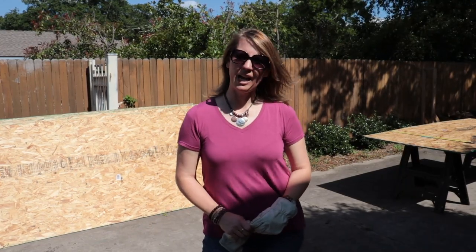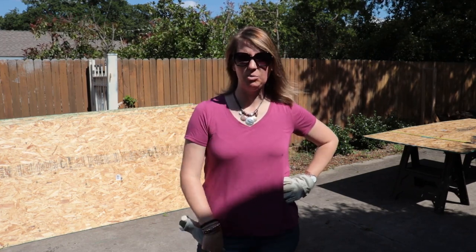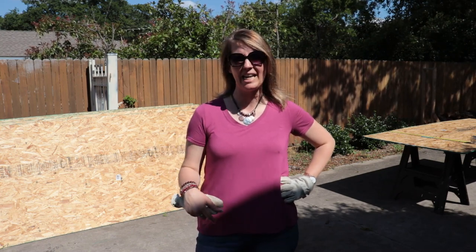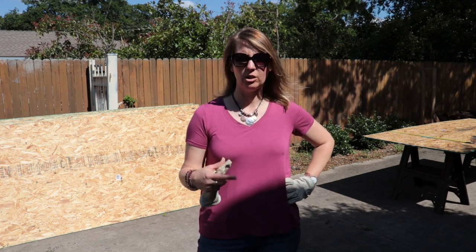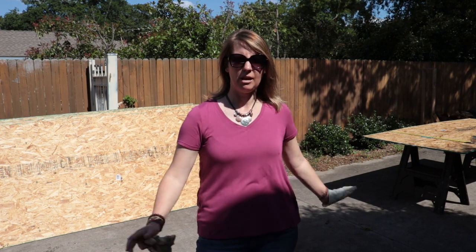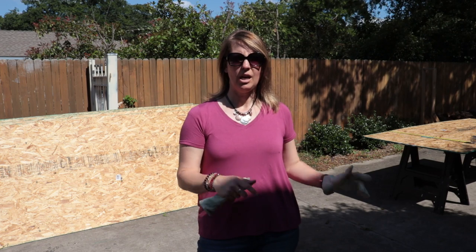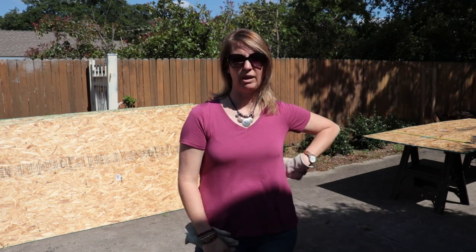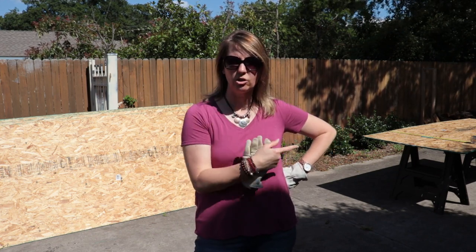Hi weekend ranchers, welcome back! We have a project — we're going to get two projects done this week so we can get our piglets, and that's tomorrow. We're going to make a pig pen out of plywood and two by fours. First I'm going to strip down the plywood four by eights to make them shorter for the walls, then lay two down on the floor and make a pattern to screw through to a couple supports, flip that over, and build our wall system around it with two by fours.